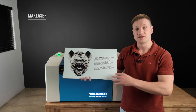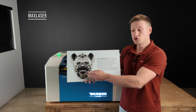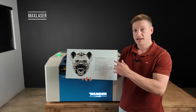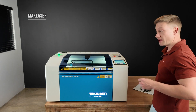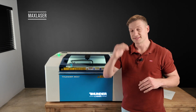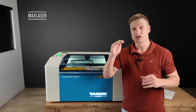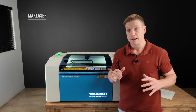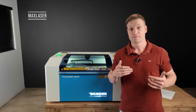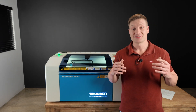You're also trying not to bow the material and still not have lines and ridges — it's pretty hectic. The z-axis height matters here: the image is on a different height and the text is on a different height. I couldn't have done it without the Thunderbolt, to be honest. On the touchscreen it actually tells you your z-axis height, so I can go to a 0.1mm adjustment, which was absolutely fantastic. There were a couple of things I had to figure out to really nail the image engraving and also the text.